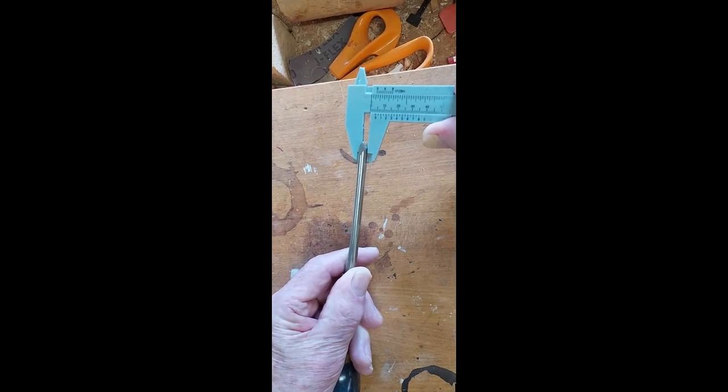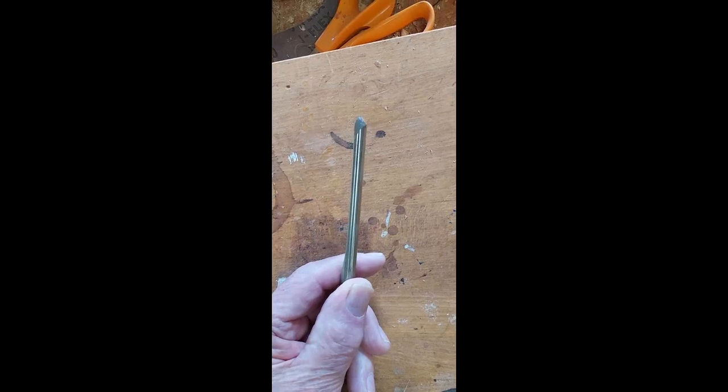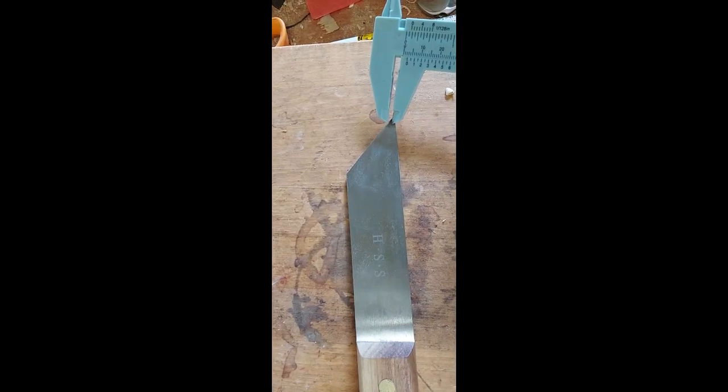One of the things you can do to improve this is to grind the tip off. Cut it off so it will put the cutting edge at about the same point as your spindle gouge you're using — whether it's three-eighths, maybe three-sixteenths, if it's a half, maybe a quarter — and then you're going to do the same thing, cut that tip off.